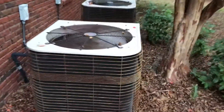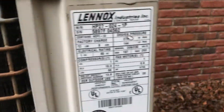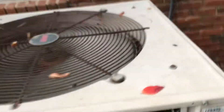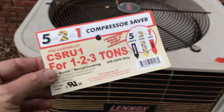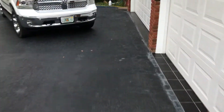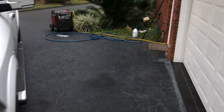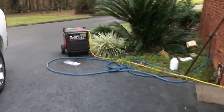So now we're starting our two-ton unit with no problem. With this installed, the 7,000-watt Honda will easily start your home two-ton central air conditioning unit. I put one on my four-ton unit, and it will start the four-ton unit also.